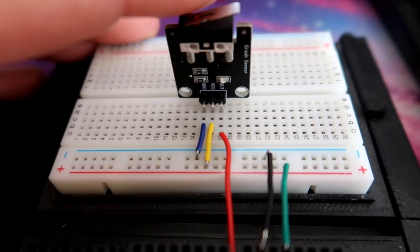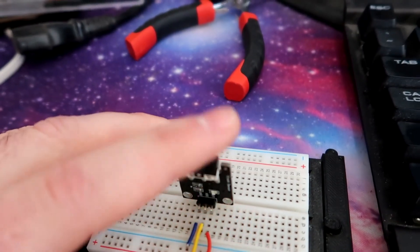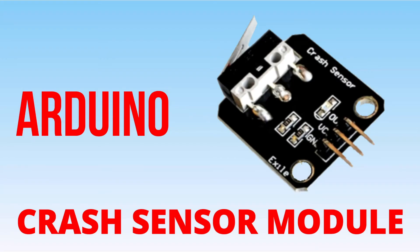Because the digital pin of this sensor is set at one all the time except when you push the switch down, we'll always see a one until we hold the switch down and then we'll see a zero. Looking at the actual switch, clicking it down you can see that light lighting up when I'm pushing it down, and at the same time it's sending that signal to the digital pin. In the serial monitor you can see it going from one — meaning we're not touching it — to zero when we push the switch down. It's a little different from a normal switch wired directly to an Arduino, where it would be zero until pressed and then show one, but this sensor module is set up the other way around.